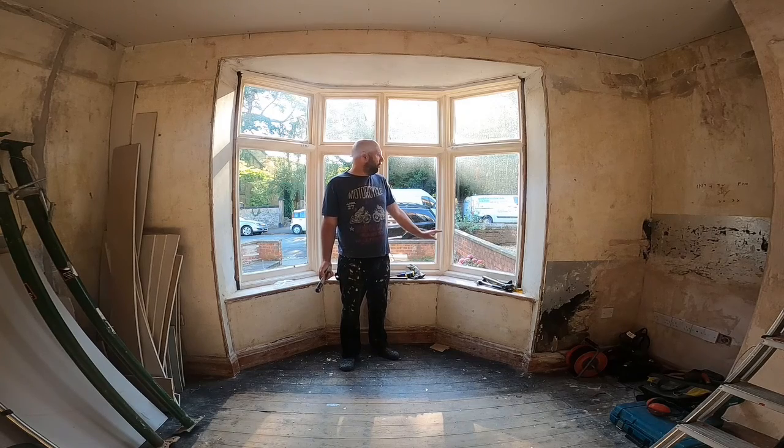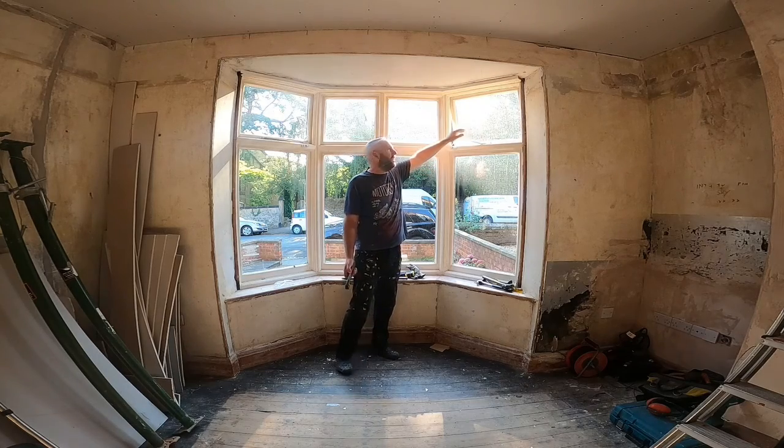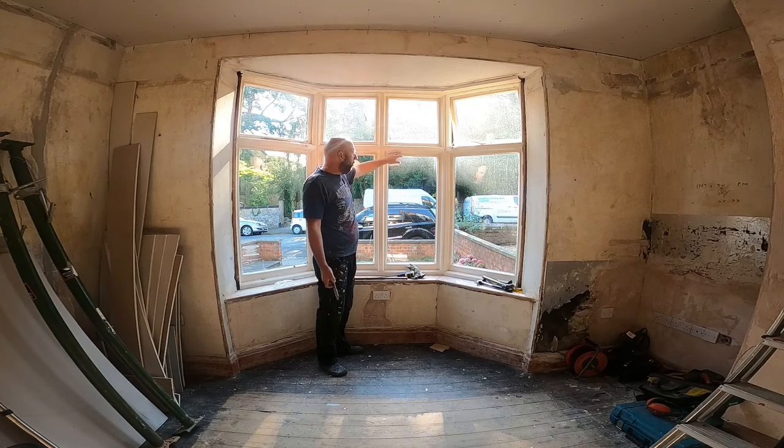So like I say, I'll show you outside, and then I'm going to start by taking the windows out. What I'll do is take the windows out, the ones that hinge like this, straight away. These bigger panes, hopefully they'll just tap out and prise out without damaging the glass in the middle. Most of the casement ones did, so I'll try and do that.